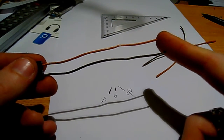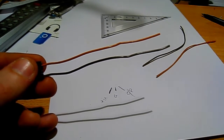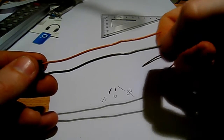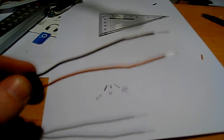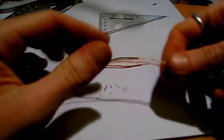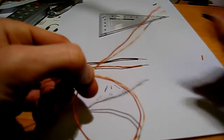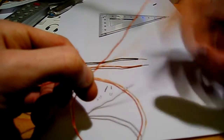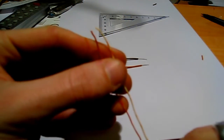Once you've chopped them off at about 90mm, you need to strip a little bit off of each end to reveal the wire underneath. Now what you need is two more pieces of wire which you picked for your LED — keep them the same colours. I picked orange and white, so I've got two more pieces of that. Strip the ends off of those as well.